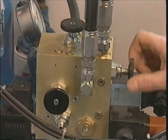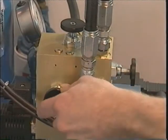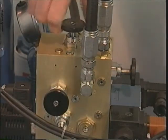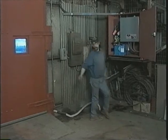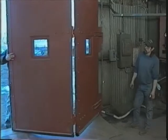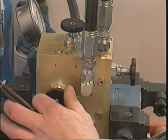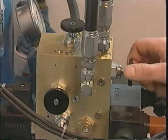The doors can be manually operated by opening valves on the pump manifold. Turning the F1, F2, and F3 valves counterclockwise puts the door in the manual operating mode. The door can also be manually released by opening the bleeder valves on each operator. However, using the valves on the pump is more convenient since they are normally located at floor level. Closing all 3 valves will put the hydraulic unit back in automatic mode. It is usually a good idea to operate the door 2 or 3 cycles after closing the manual valves to make sure that all the air has been removed from the system.